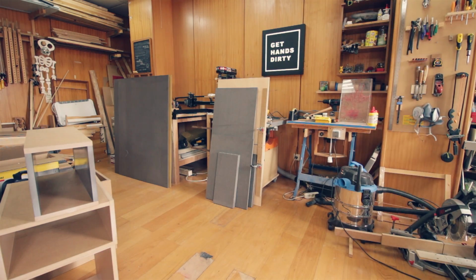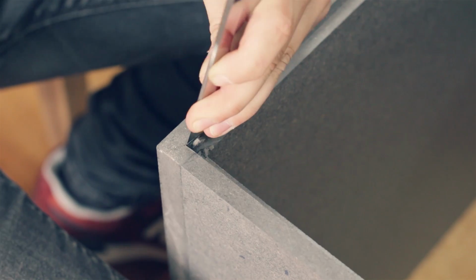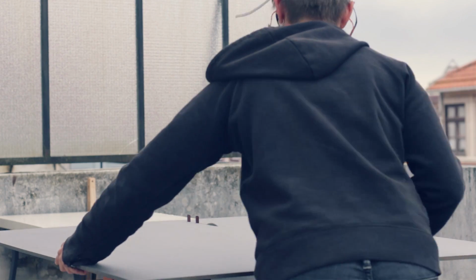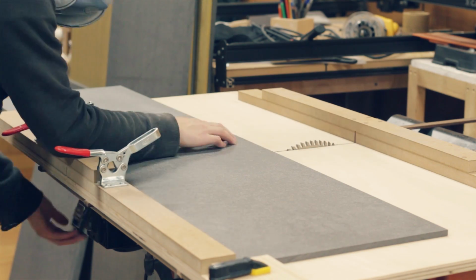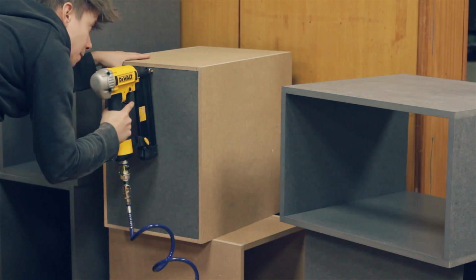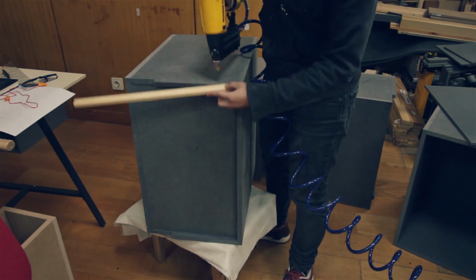I decided to pre-finish the boards from where I'll be cutting the backer boards on one side, and while that was drying I squared up all the rabbet corners. It was finally time to close the backside of the boxes, and here you see me inserting the perfectly fitted backs on the floor boxes. I don't really need many nails, it's just to keep them in place because the force from climbing the stairs will be applied vertically, so they will never want to move around.